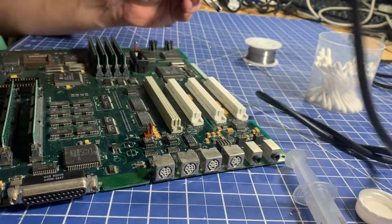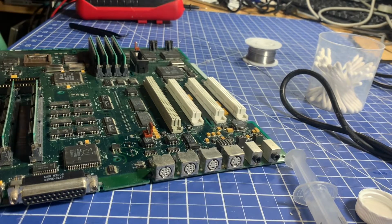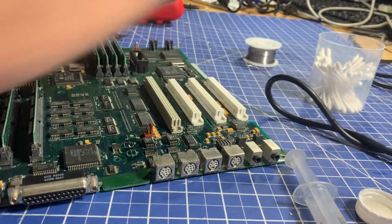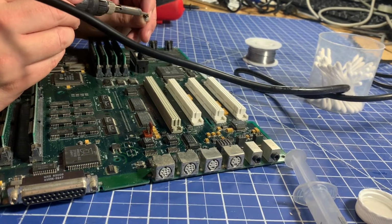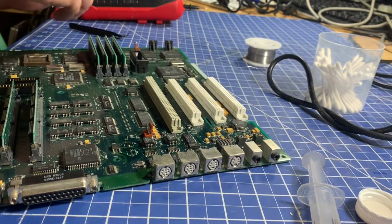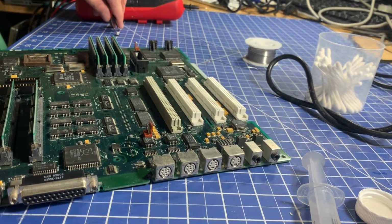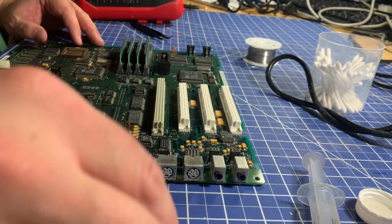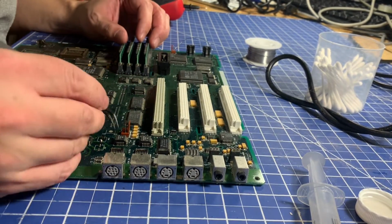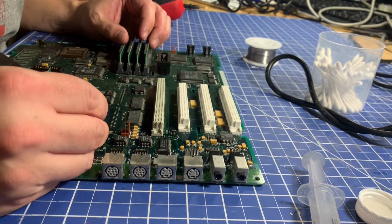Okay. I got the wire stuck to the capacitor. Off, so then I'll just make another wire quickly. Actually, I think I'm going to scrape off a little more of this pad, or the trace next to it, so that I can get a better spot to tin. Reveal some of that copper underneath.